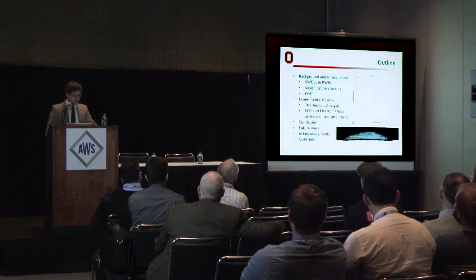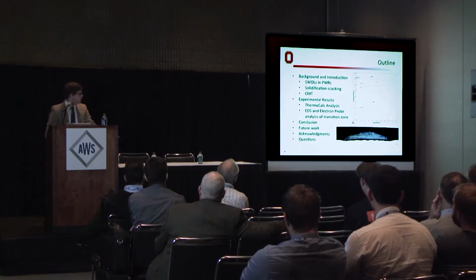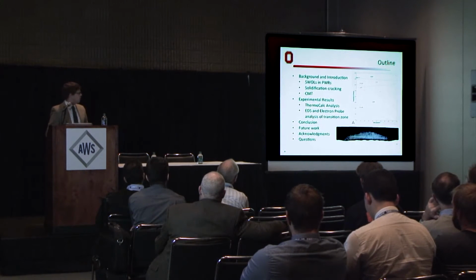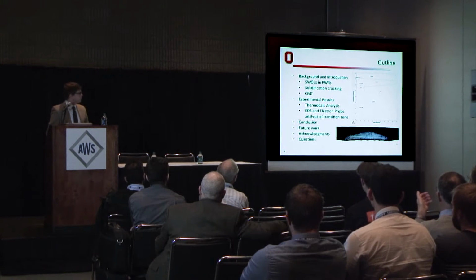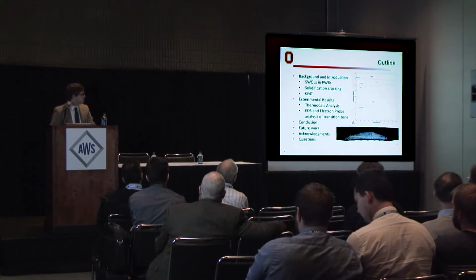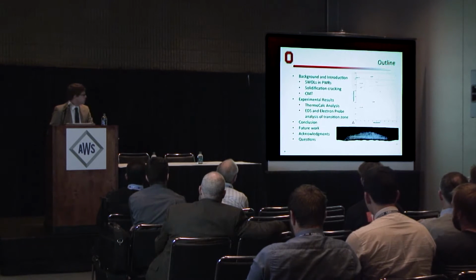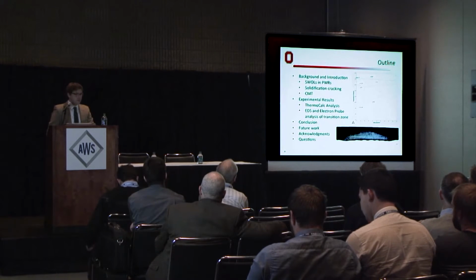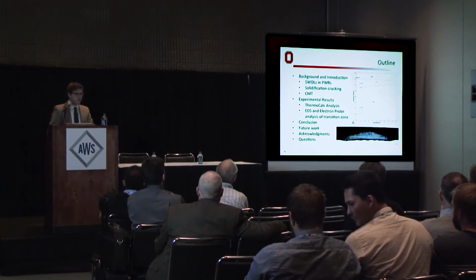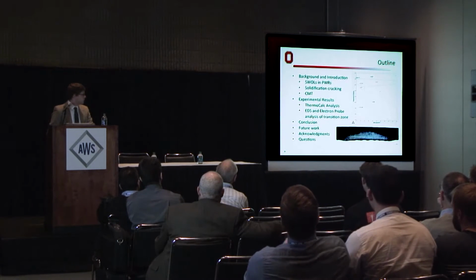Here's the outline of events that I'm going to go over today. I'm going to talk about structural weld overlays in pressurized water nuclear reactors, and then give you a very cursory overview of solidification cracking in the 52M 304L diluted system, and then talk briefly about CMT and why it's supposedly good as a low heat input process. The experimental results consist of Thermo-Calc analysis, and then EDS and electron probe analysis of the transition zone in these welds. And then I'll conclude with some concluding remarks and future work.